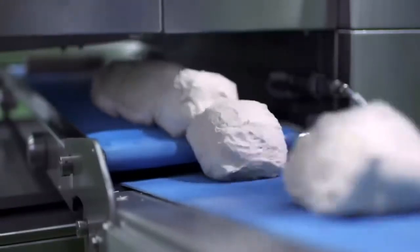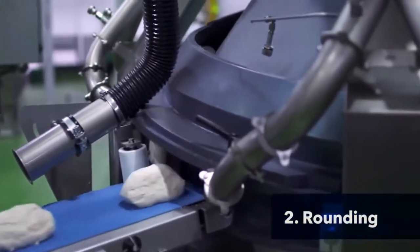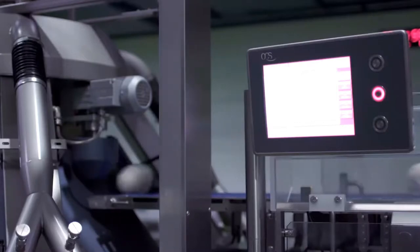This results in accurately scaled and consistent dough pieces. Second, rounding. The dough piece is rounded into a ball with a smooth surface, done on a conical equipment called the rounder. The dough piece then passes through the check weigher to ensure the correct weight of every loaf.